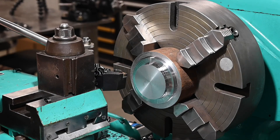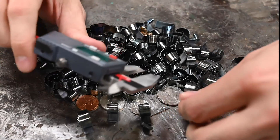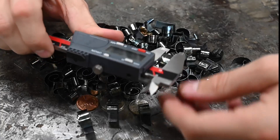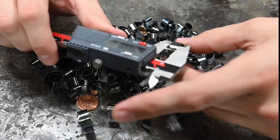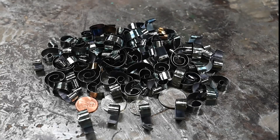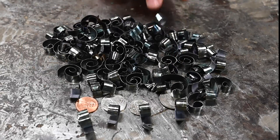Here are the results of our little experiment. Ending at 300 thou on the dial, what these chips actually measure is around 325 thou — a little bit deeper than what you dial in, and that's just because it's pulling into the work with all that tool pressure. You can see based on the color of the chips it wasn't getting pushed very hard — some are straw color, but most are just steel blue, not getting a terrible amount of heat and not turning black. And you can see just how chunky these things are.